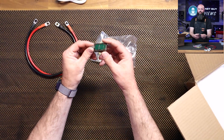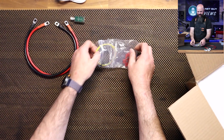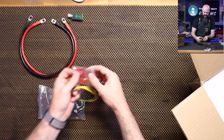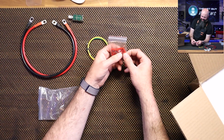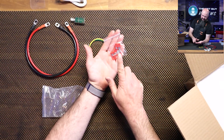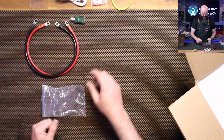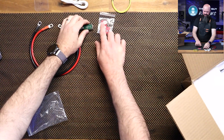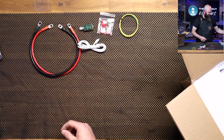It's going to have a wireless remote connector, so this is going to plug in and make the remote completely wireless so you can put it wherever you want. It's going to have a little tiny cover plate — or a sticky plate. It is going to have these extra fuses, and you're wondering why you need five — they look like 50-amp fuses. This is the reverse polarity protection, so if you hook this up backwards for whatever reason, that's going to blow the fuses already inside of it.